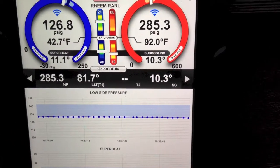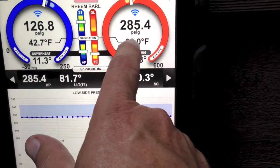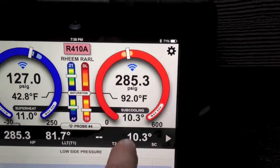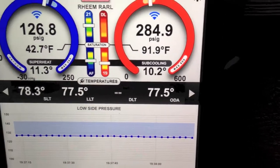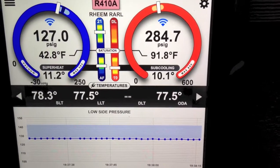Flip over again — there's my high pressure, my liquid line temperature, my subcooling, and saturation temperature for that probe. So whenever you have the wireless indicator lit, that means that it's reading saturation temperature and superheat off the probe and calculating everything that way. Swipe again and I'm back to my actual line temperatures — in this case you're just hooked up to the i-manifold sitting there in the air stream.